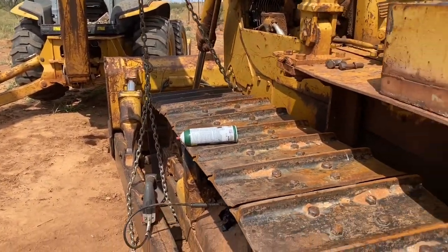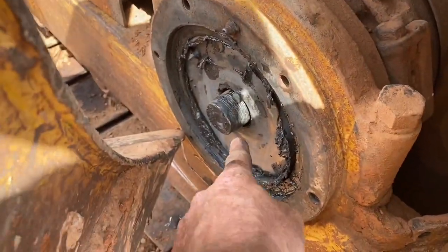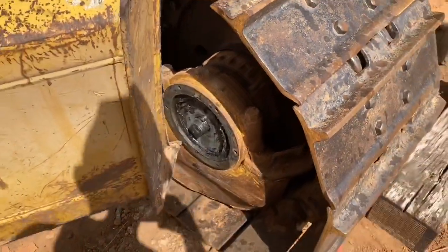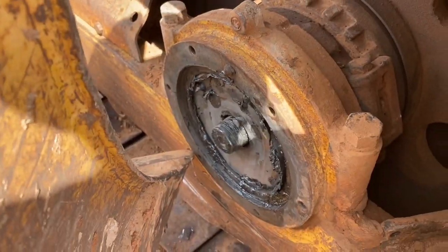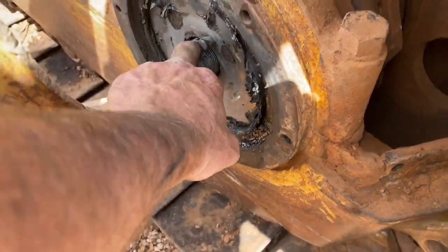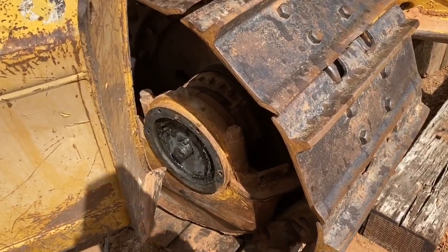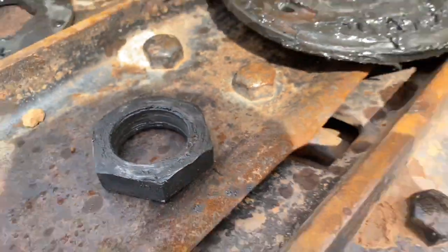This is a free floating suspension up front. The only thing that holds it secure is this spindle nut here, and the four bolts that go back there on that suspension part I was showing you on that leaf. When it broke, this whole piece came off of the final drive and was laying out here on its side. It pulled all the threads here, so we're gonna have to get that spindle replaced, or the owner is. If you look inside that nut, them threads are gone. You pulled them all out.